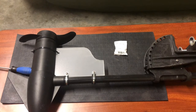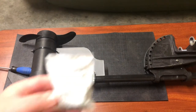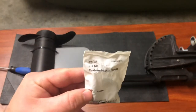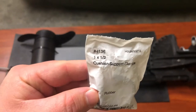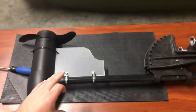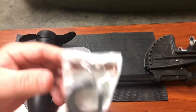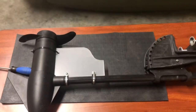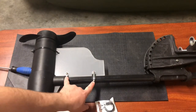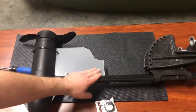All you need is these two brackets right here. I looked everywhere for these and finally found them at Menards — they're called a cushion support clamp. The trolling motor shaft is one inch, so that's what you need. The diameter is a little bit larger than one inch, so with the insert in between the clamp it actually fits perfect. It's just a thin metal band with a rubber insert in the middle, and that's going to help it stick to the trolling motor shaft a lot better.